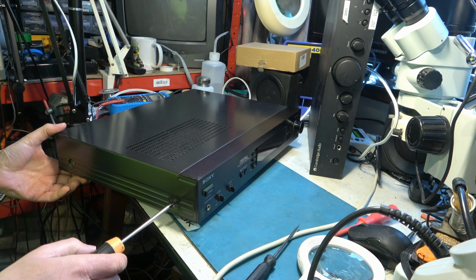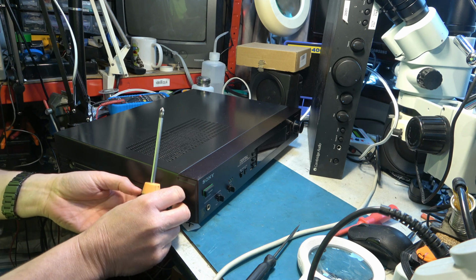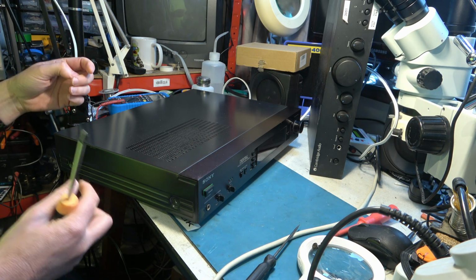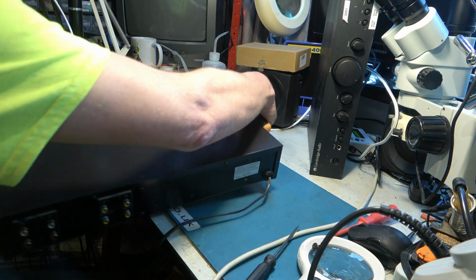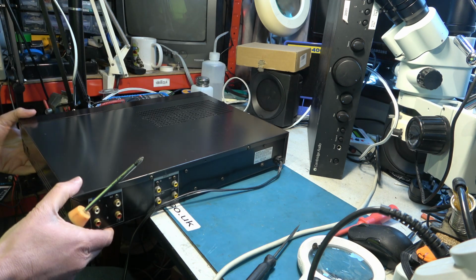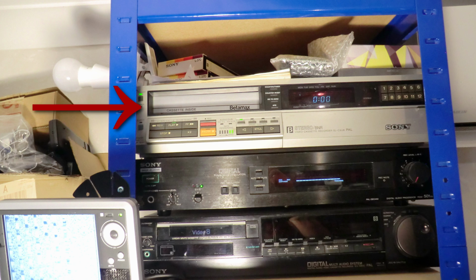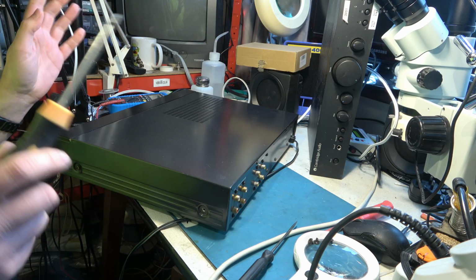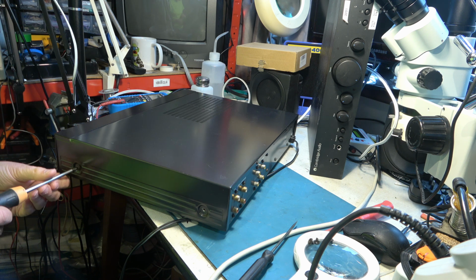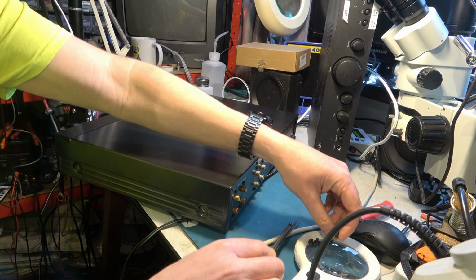It's designed to work with a domestic Betamax video recorder primarily. Would work with VHS at a push, but primarily Beta because it's got higher bandwidth and because they made some machines with a PCM digital audio switch on the back, which switched off the dropout compensator. Now, as far as I'm aware, the only machines that applied to that were sold in the UK were the SLC9 and SLF1 portable. And I can't quite remember how you do it on the portable because I don't think there's a switch as such, but there's a way of doing it. But no later machines had the PCM switch, which was a bit unfortunate.